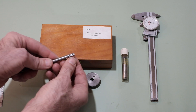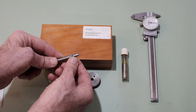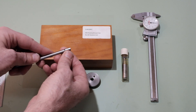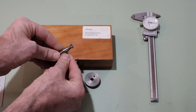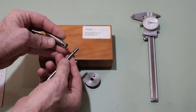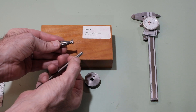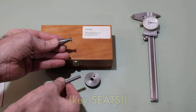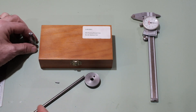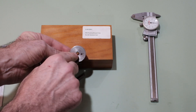First, you have to put a keyway in the shaft, and that's pretty simple to do. Machinists will use a milling cutter — you can use an end mill. I have a little tiny Woodruff cutter here; this is carbide and I found it on eBay. It's 3/32nds of an inch wide, and that's actually the cutter I use to cut these little skinny keyways on shafts. But the question is, how do you get that little keyway inside the flywheel?